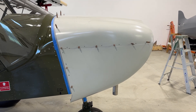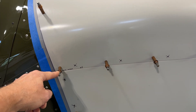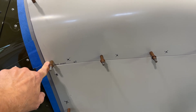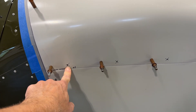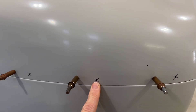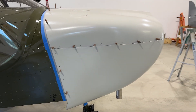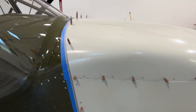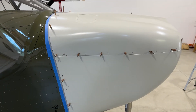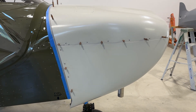So I sat back, re-evaluated everything, and decided I just want three screws on the side. The third one goes through the lip of both the bottom and top cowl, holding everything in place with one screw. That made me redo all of the ones on the top as well, so now I have all these extra holes in the cowl — which isn't a big deal since they're super easy to fill with resin, just a little extra work I created for myself. My point is: even though I gave it a lot of thought, make sure those holes are exactly where you want them before you drill.